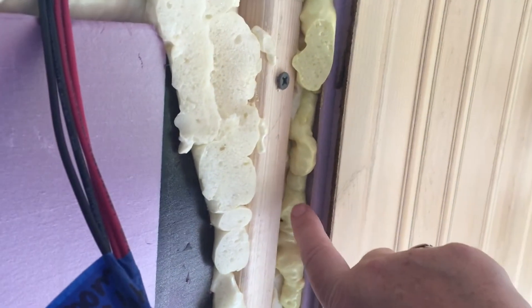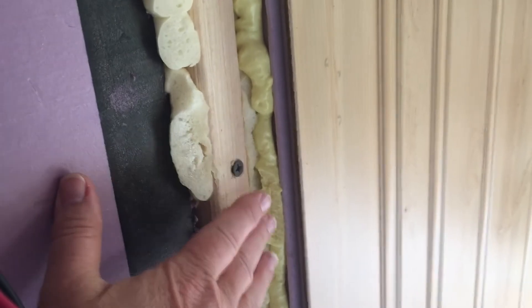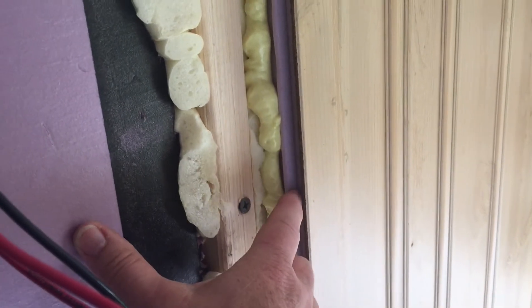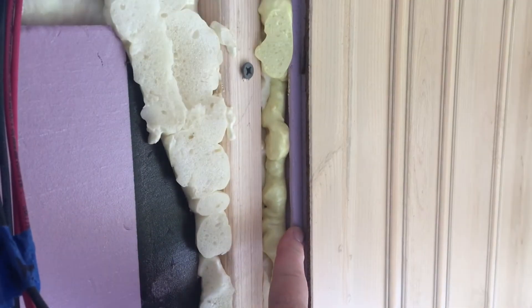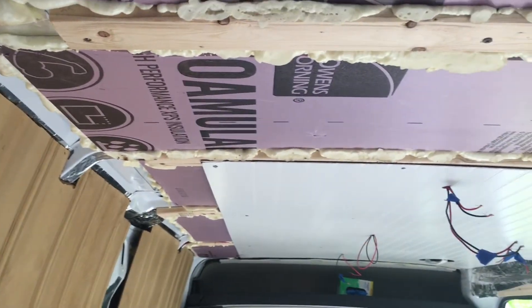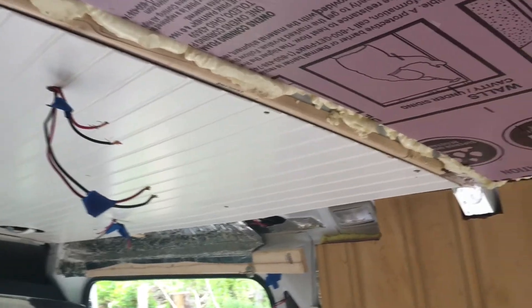It's looking really good. On this side there's two-inch insulation flush with the furring strip, and then another inch bumping out, so on part of the walls I've got an R15 — I'm pretty excited about that. Going forward, I've started hanging plywood and I do have both of my fans in.